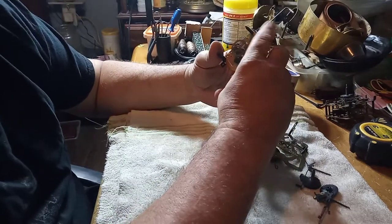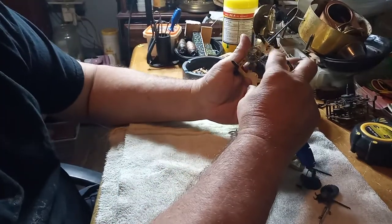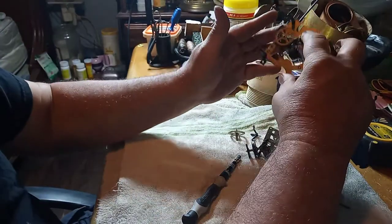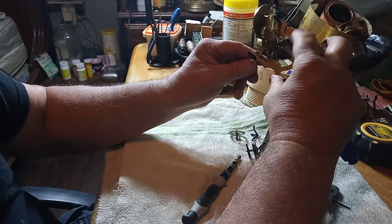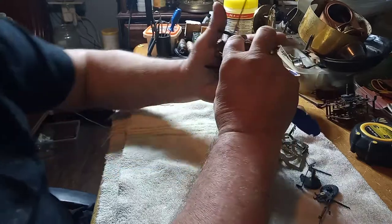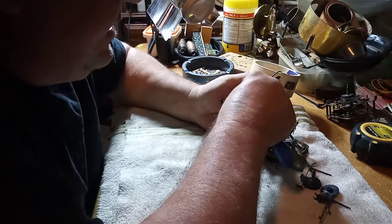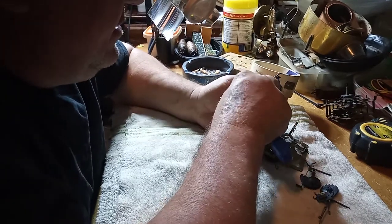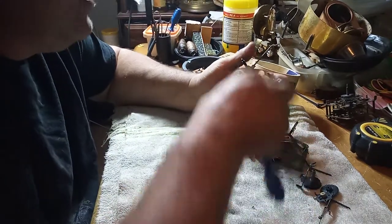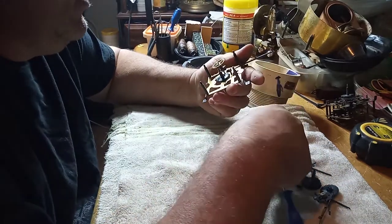You could take this piece off if you want — I'm going to go ahead and do it, but you don't have to. You just want to make sure it drops on its own easily. This is what stops your cuckoo from continuing to cuckoo. If it gets stuck up in the air it won't drop, and your clock will continue to cuckoo. I typically only take it off if it doesn't fall freely, but because this thing is so dusty I'm taking it off and cleaning it up.